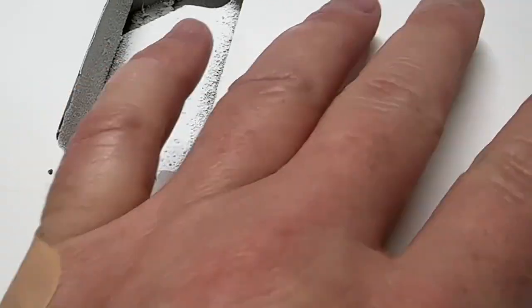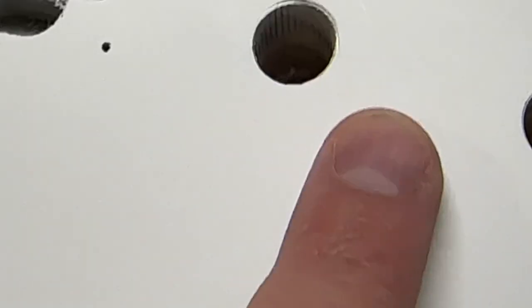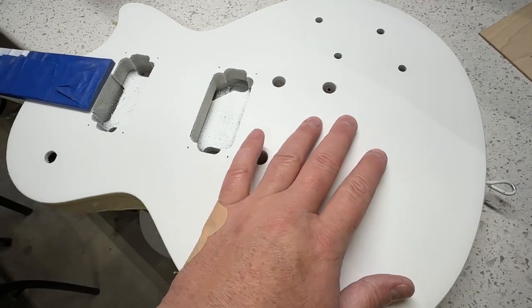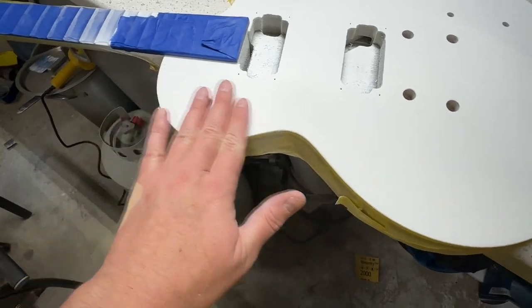So what I've done here is I've taken the little bushings out. You can still see a little bit of crack, which I think I'm okay with, because I sanded over it and it feels super smooth — you can't even feel it with your fingers. I think what happened is when I put that Titebond in there with the water it actually went down in there and is holding it open. So I'm not going to put any super glue on. I just sanded it smooth again with 600 grit, so all the bumps and stuff are out of it.